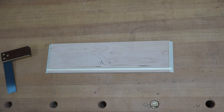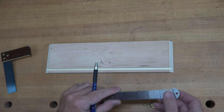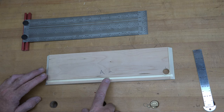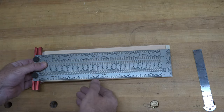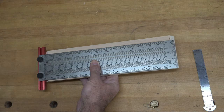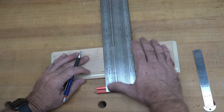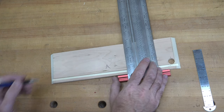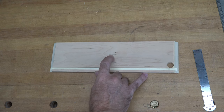Piece A will get in the bottom right-hand corner a through five-eighths diameter hole. The last hole you want to drill in piece A will be a quarter inch diameter through hole. It'll be centered on our 13 inch side — so that'll be at six and a half inches — and it will be two inches up from our bottom edge. So you can just measure up two inches and that will be our mark. We will drill that quarter inch through hole.